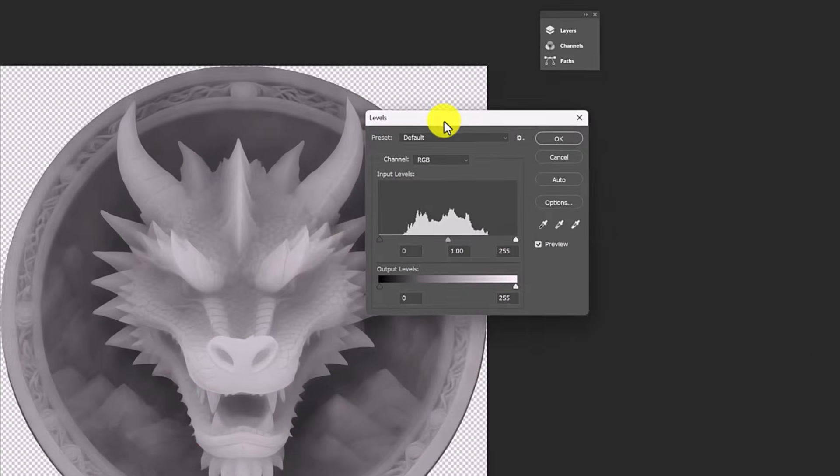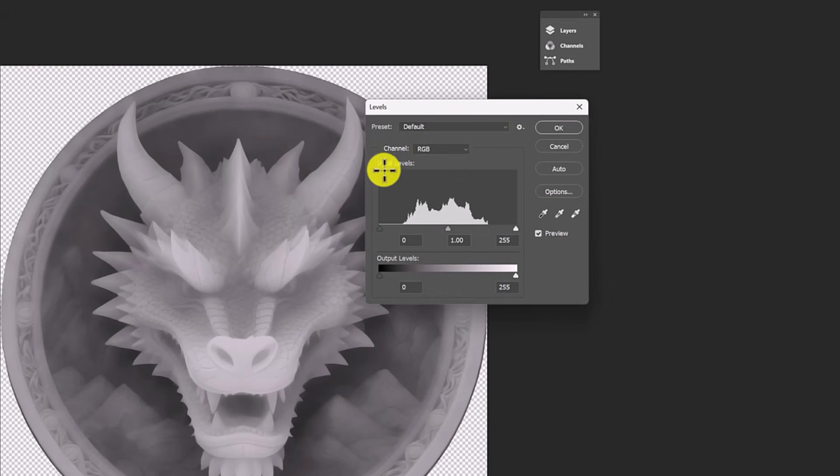Because this is a grayscale image, the histogram is showing us pixel brightness, not color. On the left side of the chart, that's the darker pixels, which are going to translate to the deeper areas of our coin engraving. On the right side, that's the lighter pixels, which are going to translate to the higher areas of our coin engraving. What I'm looking for here isn't a specific shape — it's how much of the brightness range is actually being used. In this depth map, almost all of the information is packed right there in the middle. There is no data being shown on the far left-hand side of our chart — that's the deeper areas of the coin.